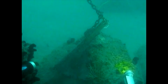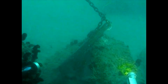There it goes. Now in slow motion, the captain, realizing the anchor is stuck, has moved the boat directly over the anchor, tied the rode off to a cleat, and is now accelerating the boat slightly, putting pressure on the release bar. The release pin snaps, enabling the boat to pull the anchor out of its lodged position to be retrieved.